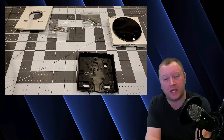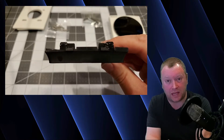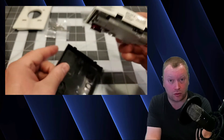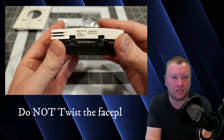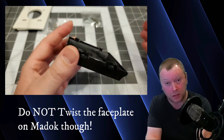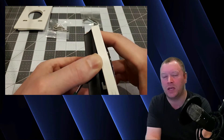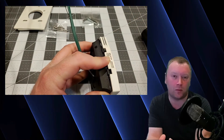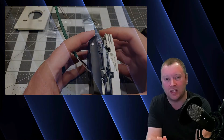The only other thing I noticed was when I was installing the Madoka Controller at my house last weekend, regarding the tabs on the backplate. If you're familiar with the Nav Controller, the faceplate and backplate come apart simply by taking a flathead screwdriver — there's a little slot at the bottom, you insert your screwdriver and twist, and the faceplate pops right off. Unfortunately, you don't want to try this with the Madoka backplate because those tabs will break if you insert a flathead and simply twist. What you actually want to do is insert your flathead screwdriver into those slots and then press upwards, which takes the tabs inwards so you can release the Madoka Controller from the backplate. Do not twist — you will break the tabs.